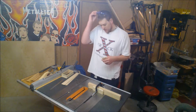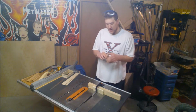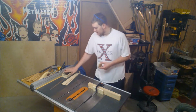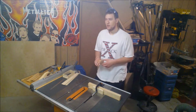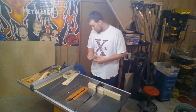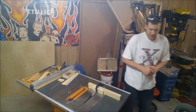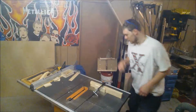When you take away the 1/4 inch for spacing to be able to pick the boxes out, we're left with 3.5 by 4 inches. And this one here is 7.25 by 4 inches, so should be pretty nice. So yeah, I'll keep going. I'll get these cut up, and then we'll set up for our dado cuts, or rabbet cuts, whatever you want to call them, that will accept the bottom panel, which will be the actual inner bottom of the box and the trays.